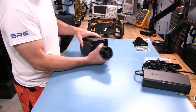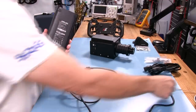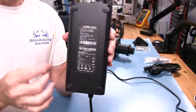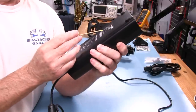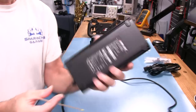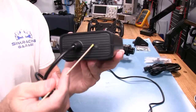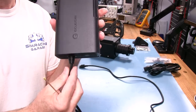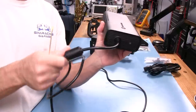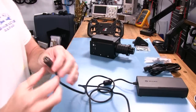Pretty clean overall package. The power supply you get is a switching power supply that will recognize the input voltage and switch automatically — 115V in North America, 240V in Europe or Asia. It is a 36V max at 6 amps peak, which is 216 watts. It feels pretty light for a 36V power supply. It has a status light that turns green when powered up, a strain relief for the cable, and a ferrite core — which means they're making an effort to mitigate EMI interference with this motor.